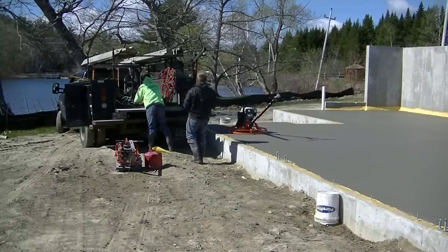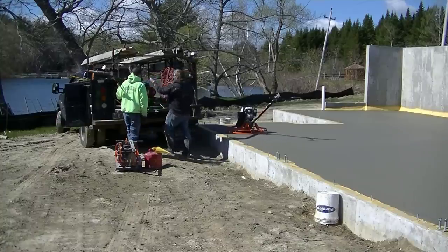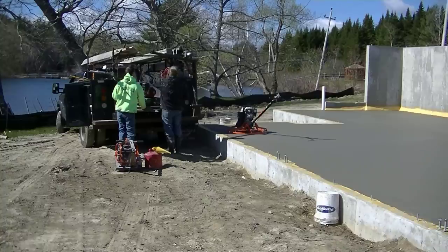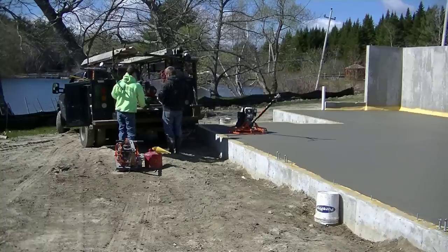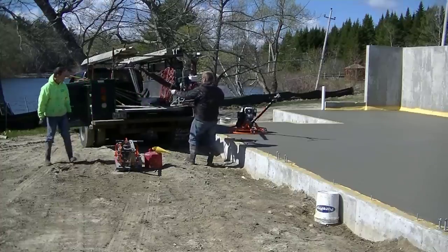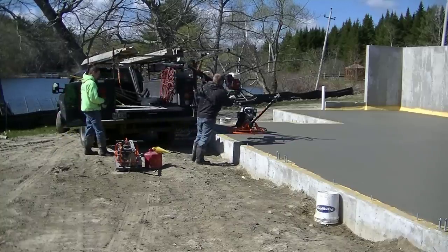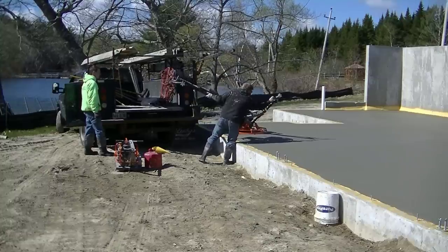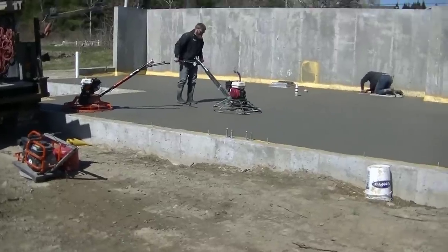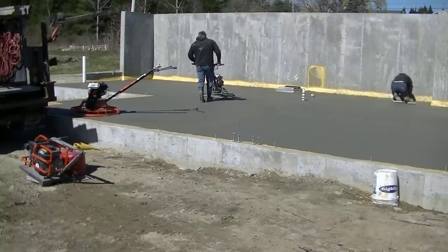We have a crane on back — I wanted to show you guys this. For you guys that do floors like we do, that crane on back is really inexpensive; you can get one for about a couple hundred bucks. I'll see if I can get a link for that in the description too. We mount a little two-ton winch on top and hook the winch to the battery. The winch comes with a remote, which makes it really easy for lifting and dropping those trowels in and out of the truck onto the floors. It lifts the three-foot and four-foot power trowels out real easy. Those cranes are definitely something you should have if you're a concrete floor guy.